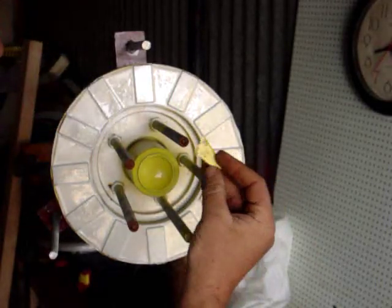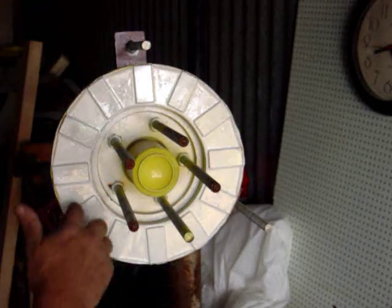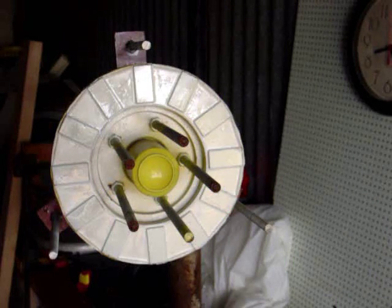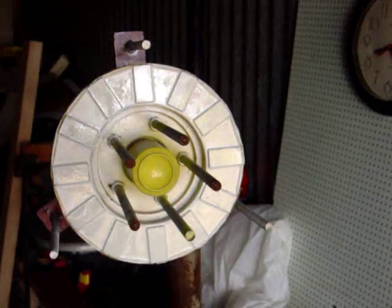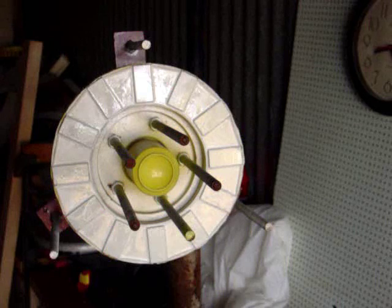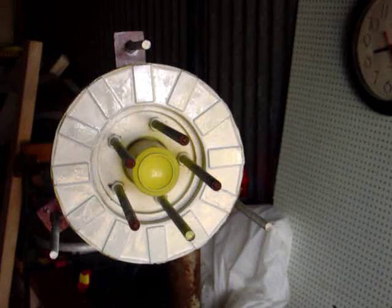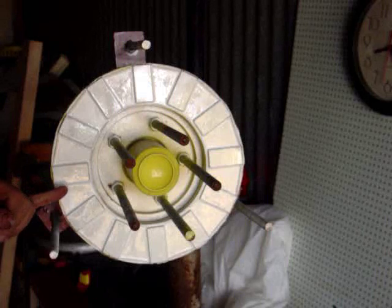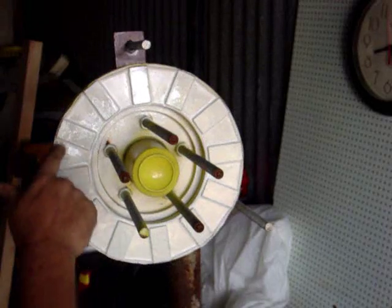These pieces kept chipping off and some of them are thicker than others, so I knocked the rest of them off. They had air behind them — but the good thing is it protected the magnets. So I took some rust-preventive white enamel spray paint and it seemed to fill all the cracks as well. Too bad I didn't have yellow from the side — it still looks yellow. That took care of that, so that'll get my stator a little bit closer. I'm going to do the same thing on the other one. I'd rather have my magnets closer anyway. The main thing is to protect the magnets. If it's got a scratch in the nickel plating that reaches down into the neodymium iron boron, they will corrode and start puffing up and getting bigger and they will wreck your stator and everything else.